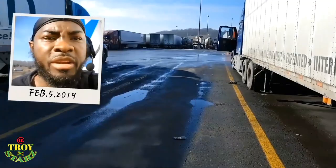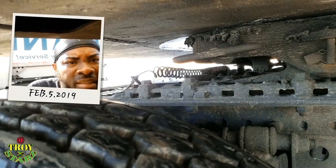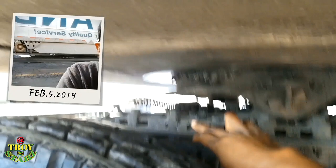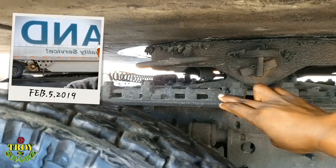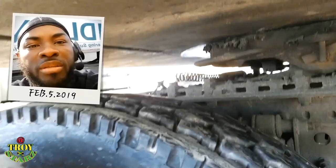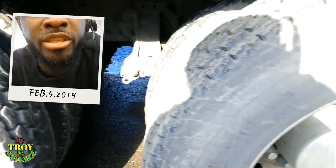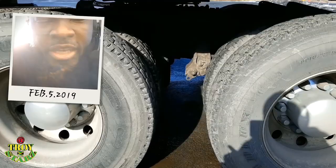This is what the drive looks like on the Volvo truck. You can see those two spikes right at the front — that is actually what I can slide. There's a button inside the truck that I can press to slide these. I'm going to slide these back. If I slide it back one hole it's 500 pounds; two holes is 1,000 pounds. So I will move 1,000 pounds from the front steer and take it back onto the drive axle — which is right here where these wheels are. I'm going to shift that weight back from the steer to the drive.